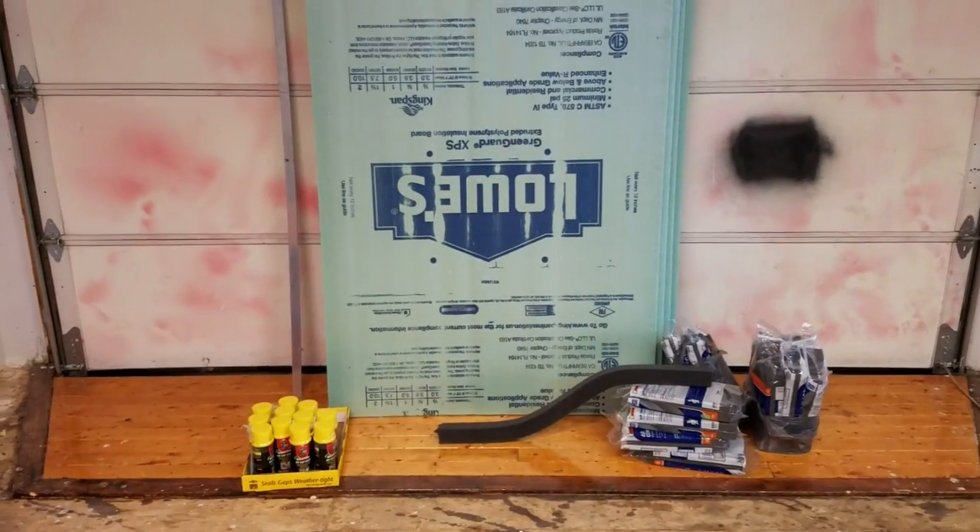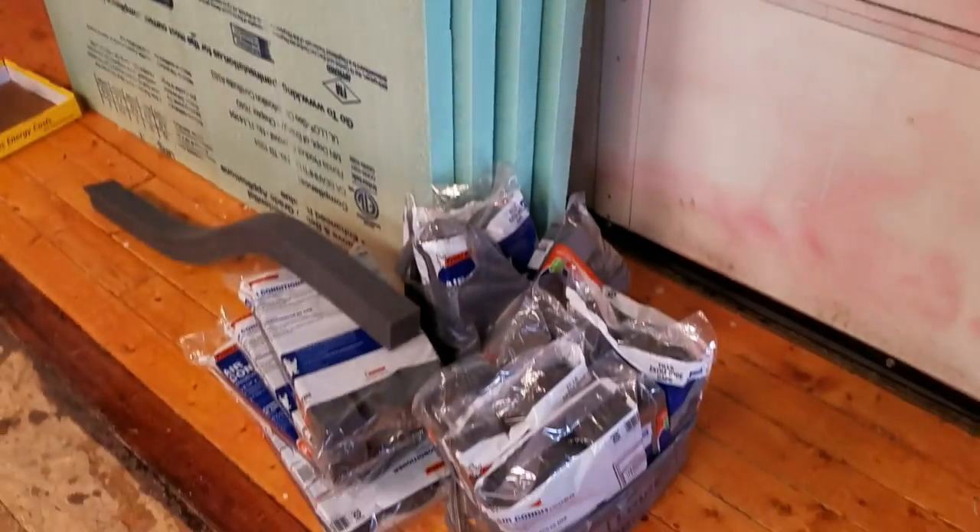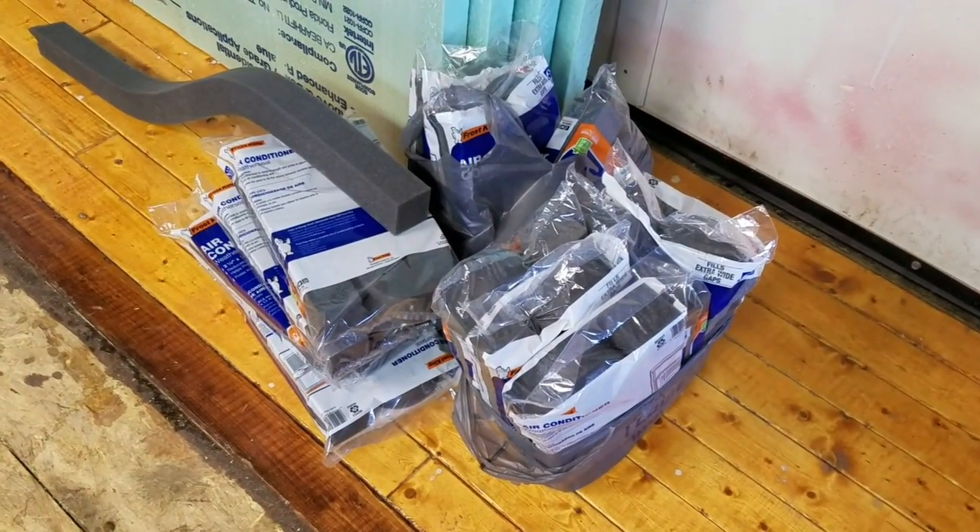It's about $250 worth of supplies. I have 11 cans of expanding foam, a piece of aluminum strip, four sheets of two-inch foam, and not quite enough of this two-and-a-quarter-inch square stock. The door itself has inch-and-a-half foam panels which work reasonably well but are marginal — rated maybe R5 to R7. Once I get all the stiles and rails insulated and the edges better sealed to reduce air intrusion, I'm going to bump this door up to at least R15.